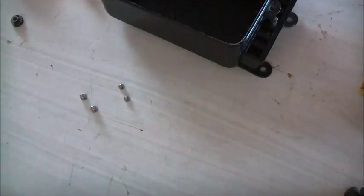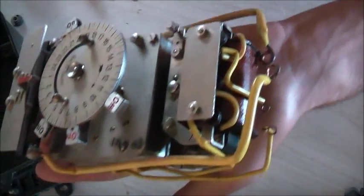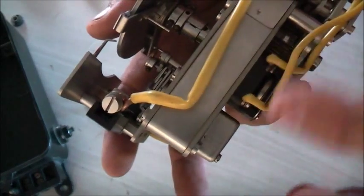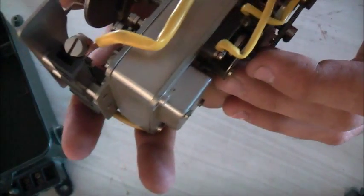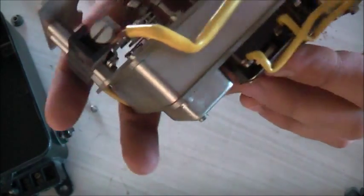I was using this FR sort of time switch and I noticed it wasn't turning back on. I thought the motor had burnt out. But I got it all opened up — you only undo these little terminal screws to the motor and two switch contacts, and it comes out of its case quite easily. After putting the multimeter probes on, I probed the motor windings directly and the motor's fine. But behind here there's a little contact — that disc pops back across two contacts. On close inspection, those contacts have got crud built up on them. That's actually a bad connection — I'm not getting any reading across this switch, so it's quite a bad connection in there. I get 240 volts in through here and nothing comes back.